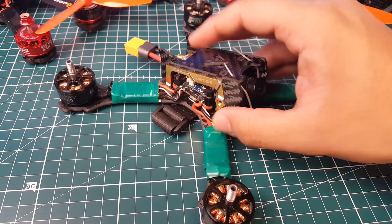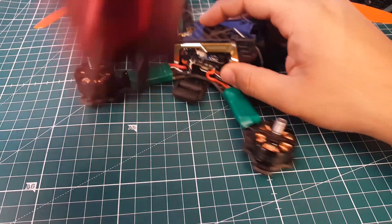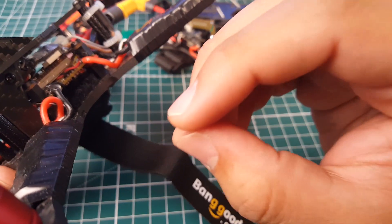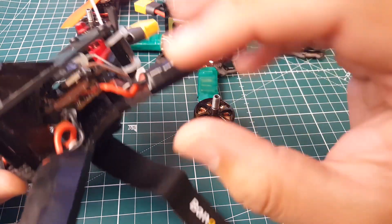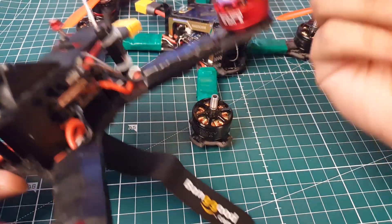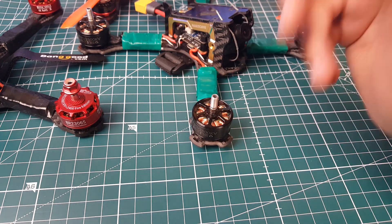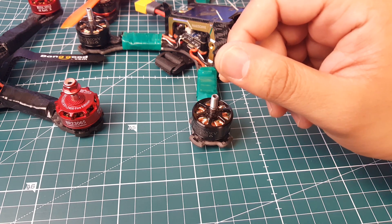This is why I tend to go for this flight controller especially when I don't know the hardware I'll be using. For our waterproof build I chose the HLRC F4 Flame because it's beautiful for waterproofing — no connectors, everything is soldered on — and I know it's reliable. If there is any issue, the fix is simple: one low ESR capacitor for noise. But with the board doing half the filtration already, I don't think you can go wrong. Plus, it's only about 35 dollars.